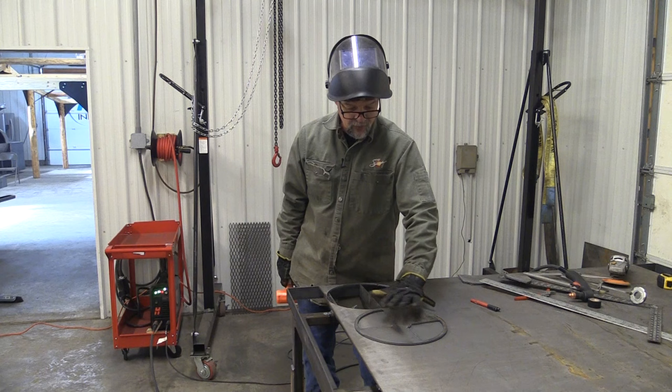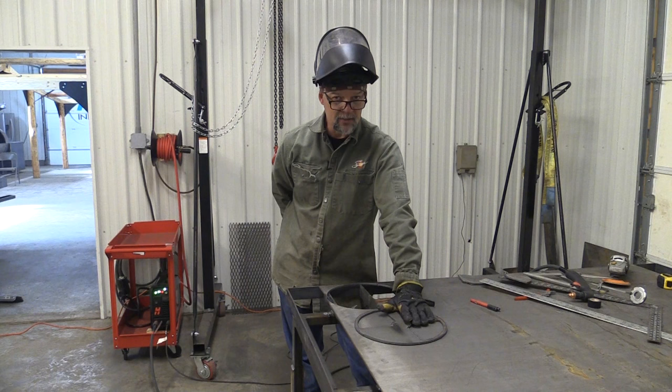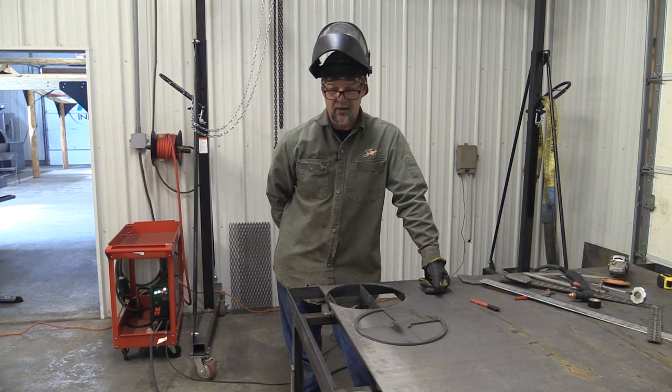If you have an anti-skid mat, like one of those horse trailer mats, this will stay put real good. You can clamp it down, whatever. Use a flat hard disc, one that's meant for going flat, and you can knock this dross off pretty quick, especially if you're painting it and the color of the steel is not a problem.